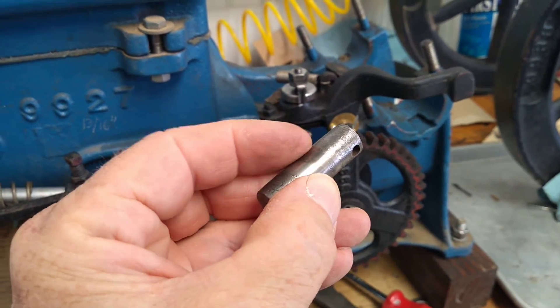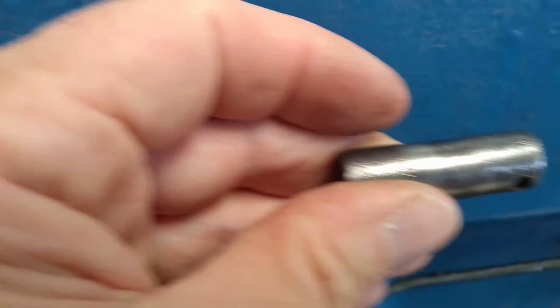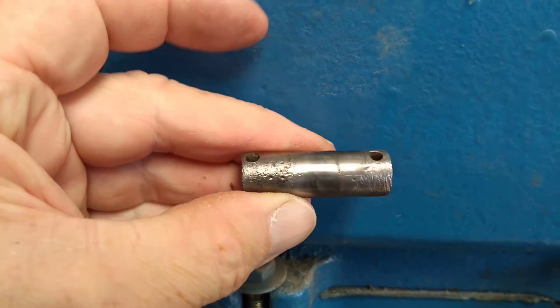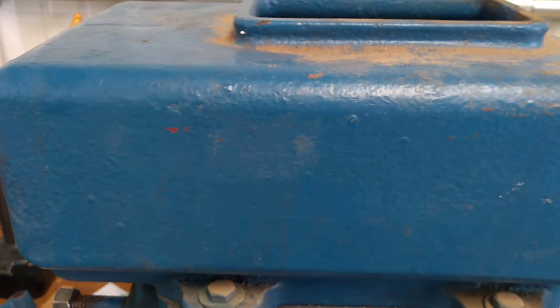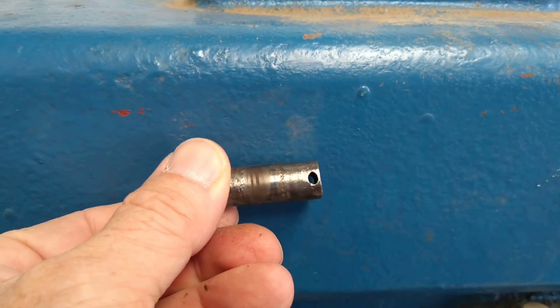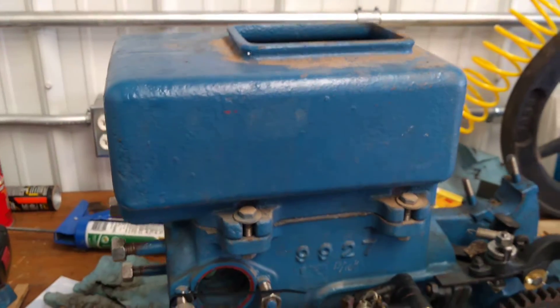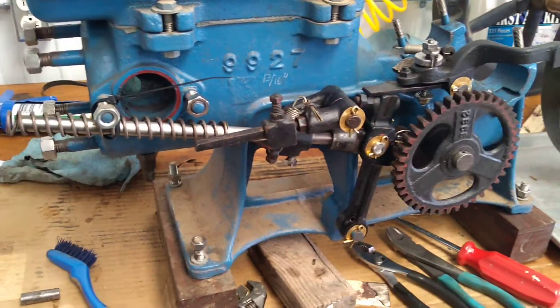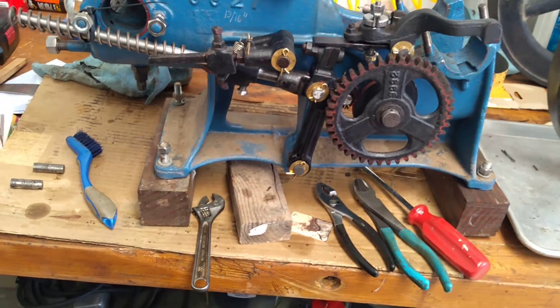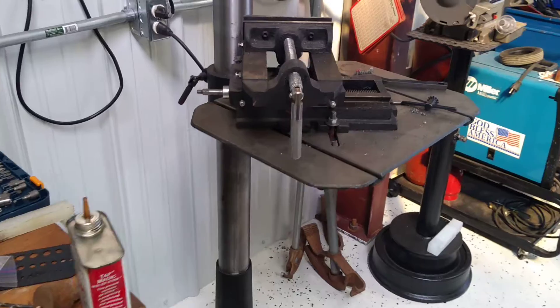You can see a lot of wear right here where my finger is, right up against the hopper. You can see how much wear there was — quite a bit of pitting. This one is pretty bad as well. I had some half-inch round bar in stock, so I went ahead and put it in the band saw, cut some new pins to length, drilled them, and all of that.